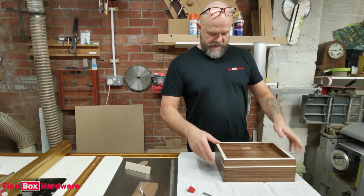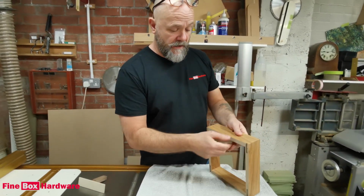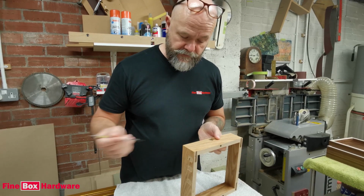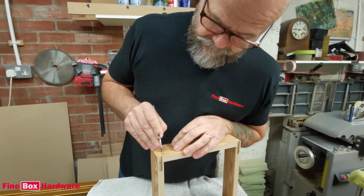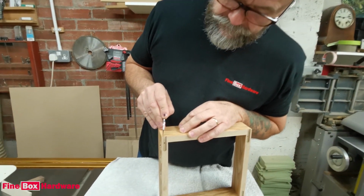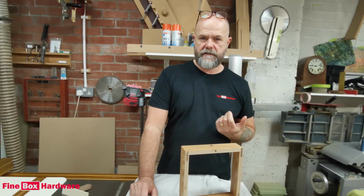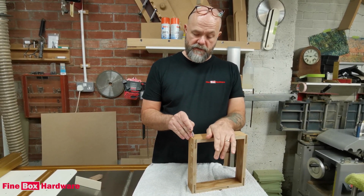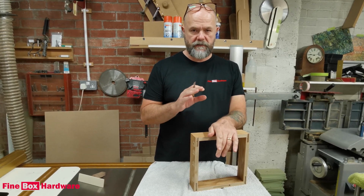Now the next thing is what I want to show. I'll show you quickly in this scrap box. If we were going to make mortise cuts here, remember this is just scrap, on your first cuts, on veneer, not so much in solid wood, it can flick off a wee bit of veneer at this area. It can also flick off that wee tiny part at this miter, which, to be quite honest, is a pain to get fixed. So first, we want to scribe a few marks here so that we're not going to break out on our veneer.